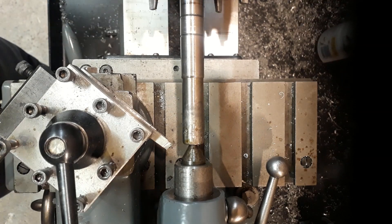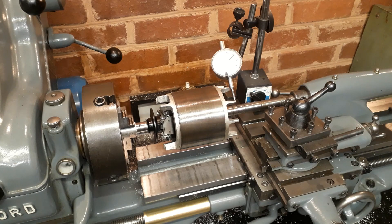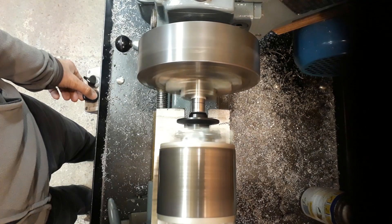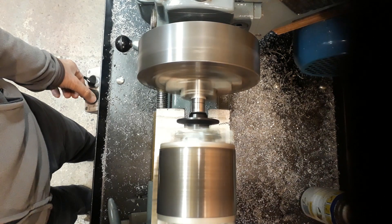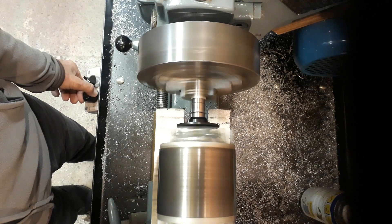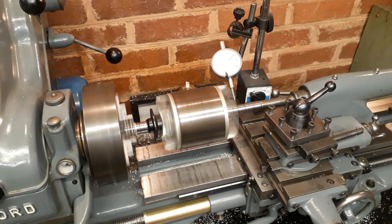I think that's as good as we're going to get. While we've got this set up in the lathe and I've got my lathe running on the higher speed setting, I thought it would be a good idea just to check the centrifugal switch for the starter coil, just to see if that's working. We'll ramp the speed up and see if the centrifugal switch operates. That looks fine.